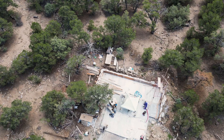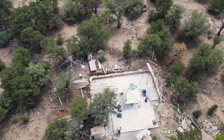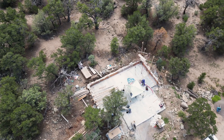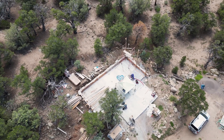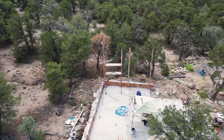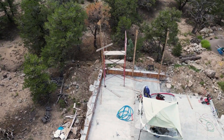Not having to run back and forth to the hardware store for all kinds of stuff — we need Portland cement and our form material, and the form material will get used up when we sheet the roof. There's very, very little waste in this project. We'll do maybe 15 or 20 full batches of AirCrete, and at the end we throw out maybe a five gallon bucket of AirCrete when cleaning up at the end of the day. It's almost zero waste.